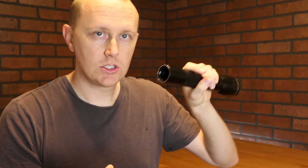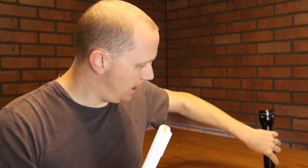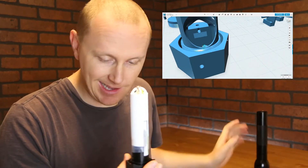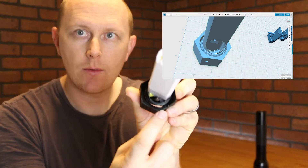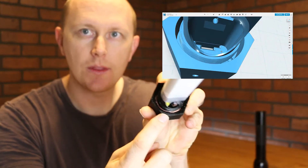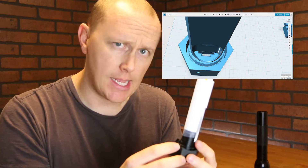Plastic on metal. One of the things that the end cap does on a Maglite is it contacts the casing — that's negative, that's the ground. I ended up having to put in the design a hole on the bottom that would let me run a piece of copper wiring around so it would then contact the casing for negative.